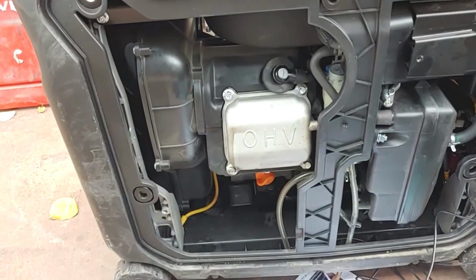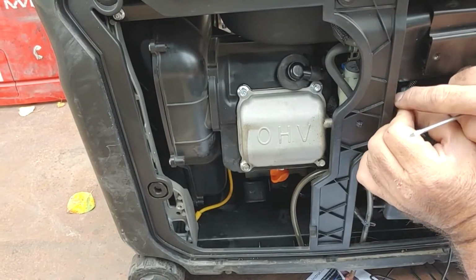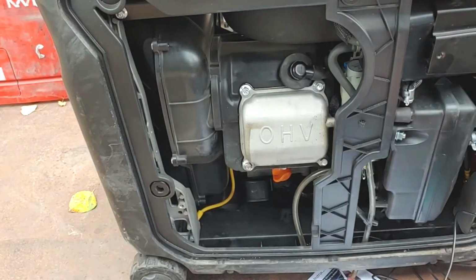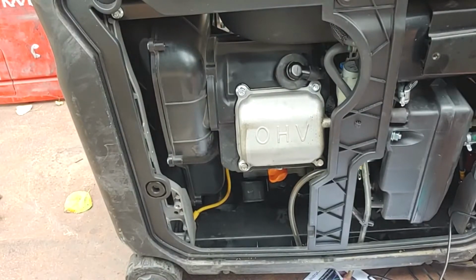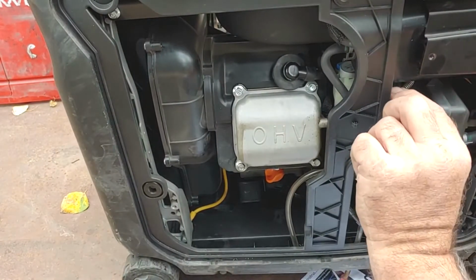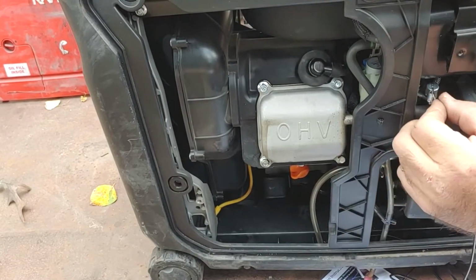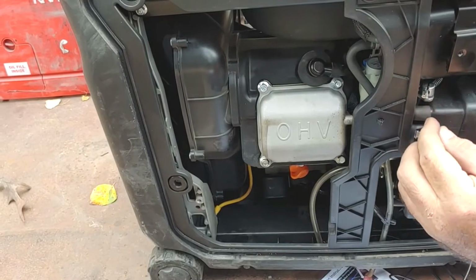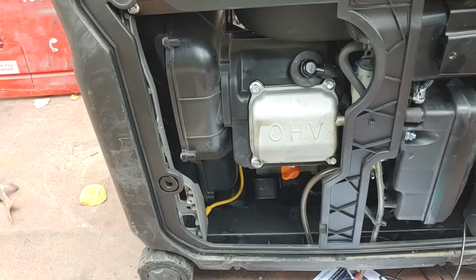All right, so now it's set. Twist the choke cable so it's under the actuator cable, pictured above. Check. Alright, show cables underneath the actuator cable. Check. Alright. Reattach spring. Got it. Attach the actuator bracket.